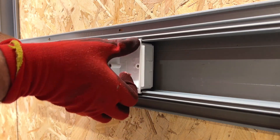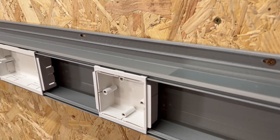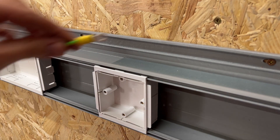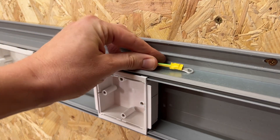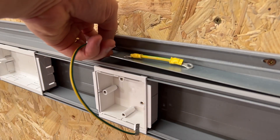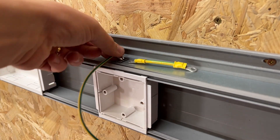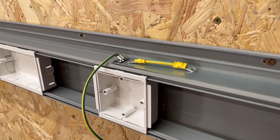Another really great device that works well with this range is the mains crossover bridge. This sits in the middle compartment of the trunking and allows Band 1 cables to be routed from one of the outer compartments to the other while maintaining segregation from the mains cables in the centre section. In places where you want a higher level of integrity in data transfers, you can add steel screening dividers into the top and middle compartments. When these are earthed via bonding straps, there is a big reduction in electromagnetic contamination of signals in the data cable, ensuring the dado trunking is CAT 7A compliant.